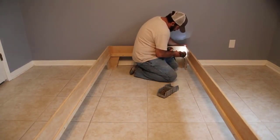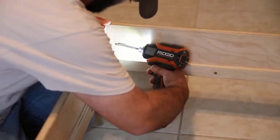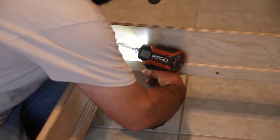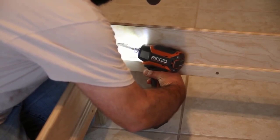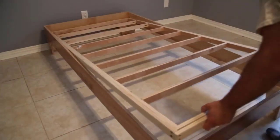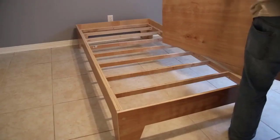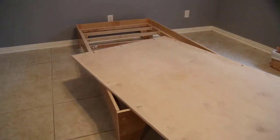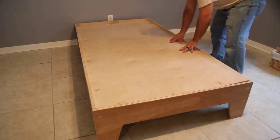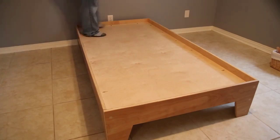This is something that will last you as well. These legs go together with just three pocket holes — really easy. The support ledge on the inside of the bed frame adds a lot of support once you add the lower support assembly, which rests right on top of that ledge. With a couple of screws on each side you're good to go. Then you add the support panel — it has pocket holes on the top side. Make sure it's seated nice and tight all the way down to the lower support assembly, then add the pocket hole screws all the way around.